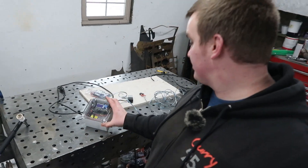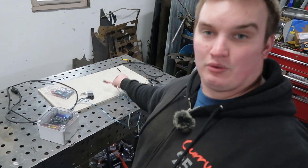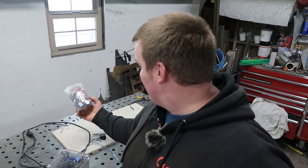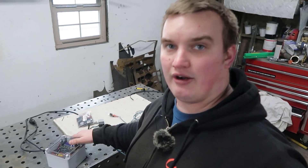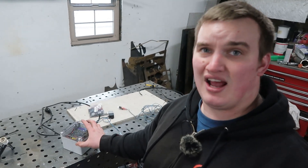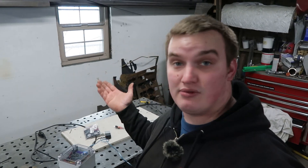We've got this thing all in the enclosure and it looks good, seems to function good. Left a little bit of lead for our pneumatic cylinder. We've got about 15 feet of tail for our switch which we're going to mount to our pedal in a little bit. I originally was going to put one of these little muffin fans in here for airflow to keep the power supply cool, but this little 5 amp power supply is not making hardly any heat anyway, and I'd like to keep dust out of it. If it gets warm down the road I'll put a fan in, but for now it seems to be working good. Next up is getting it mounted.